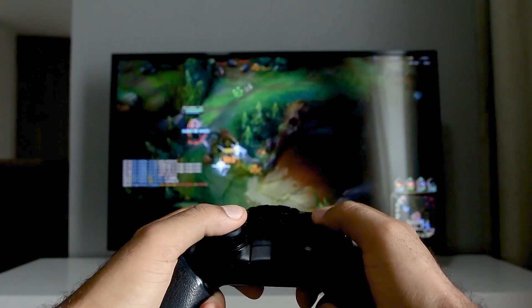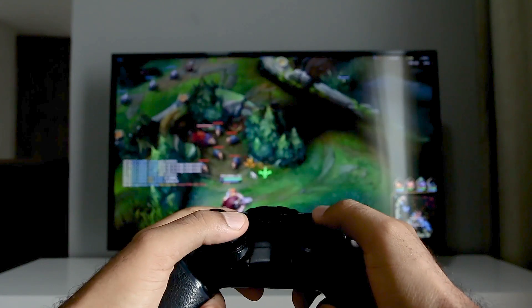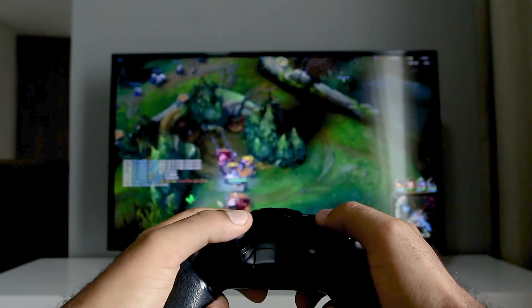We still have two axes of orientation here, and they are far more reliable than with just a 3-DOF accelerometer IMU. In some cases you may only need two accurate axes, such as a pointing device or gaming controller, which can only move within two axes of a TV screen. Six DOF sensors are also significantly cheaper than nine DOF sensors, so if you only need those two axes, you can save money by going with a 6-DOF IMU.